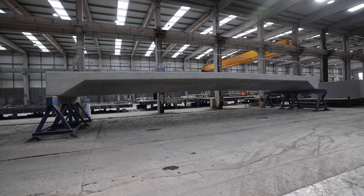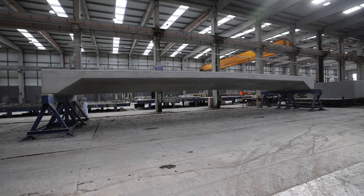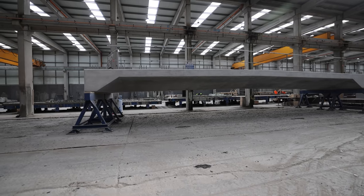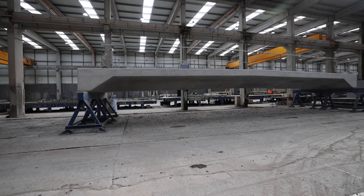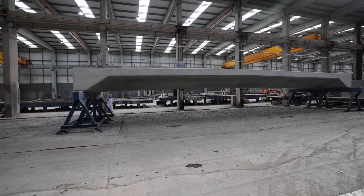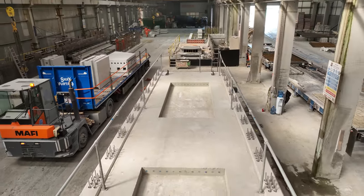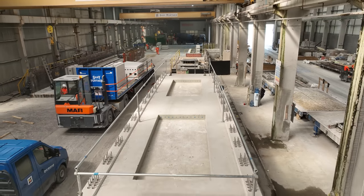So this is your footbridge — this is going to connect the two lift shafts. As we mentioned, the third lift shaft they're just stripping out as a cantilever deck, and where you can see the bridge deck sat on the trestles either side, that will basically sit on those two cantilever decks. The bolt clusters you can see along the top are cast in by Shays — all stainless — and then a stainless steel handrailing gets bolted onto the top from Stoneman Engineering at a later date.